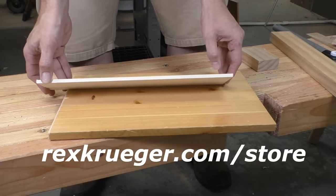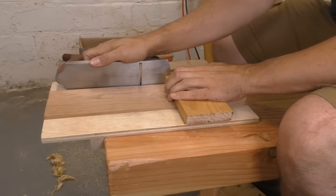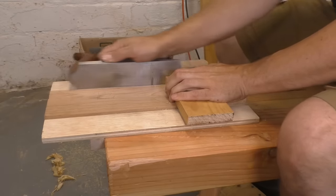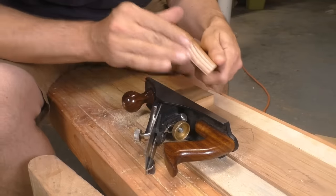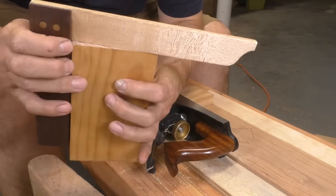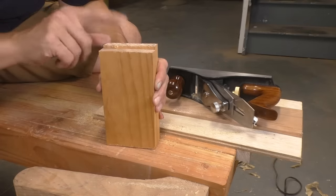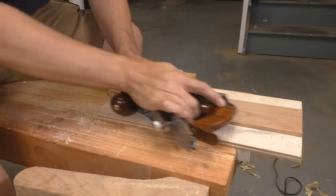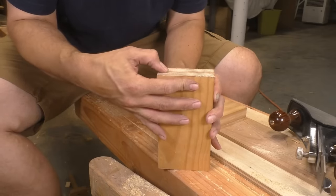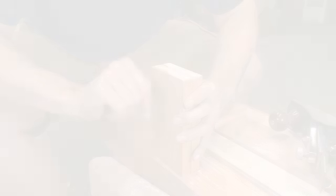Because I used a rough saw, my pieces are quite ragged, and I'm going to need to clean these up and make them perfectly straight and square for joinery. This is the perfect job for my shooting board — I built this two weeks ago, and there's a complete build video and plans available on my website. Using this shooting board combined with my new Grizzly Smoothing Plane, I can get perfectly flat 90-degree ends. For each component, I start by getting one end straight and square, then flip it and clean up the other end. I need both components to match perfectly, so I'll put the two together, see how much material I have to remove, and slowly sneak up on my first component until the two are perfectly flush. When they're really even to the touch, they're good enough for joinery.